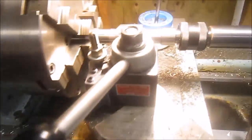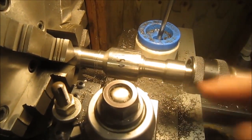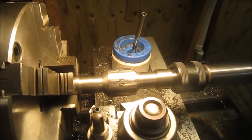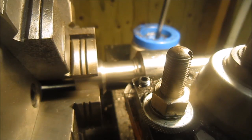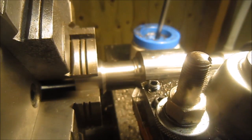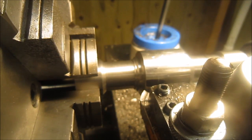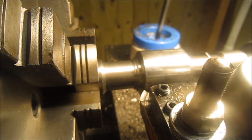I'm down to almost my final bit of lathe work here — just got to turn the part around and cut the chamfer on this side. The way I've been cutting these angles — and there's probably a simpler way — but basically I have my tool set on zero for my depth and then I'm using the compound cutting it at 45 degrees, basically whittling back. I could take bigger cuts and get there faster, but I'm too close to the end to change how I've been doing things, and I don't need Mr. Bozo to show up.